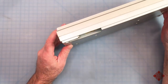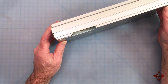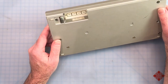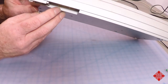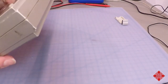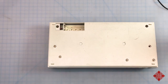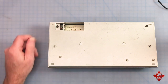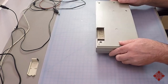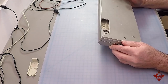And while we're in there, we can see that the serial number, on the little sticker on the inside of the instrument here, is 208,600. I'm not sure if you can read that. But why that's relevant is that there are some different versions of the circuit that was used in this instrument. And so we know that this is a later version of the instrument, so it's not going to have one of the earliest circuits in it. And so we can use that in our diagnosis.